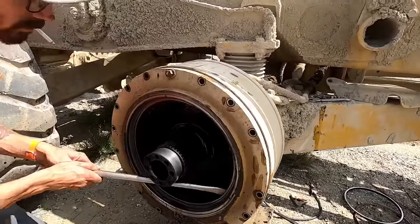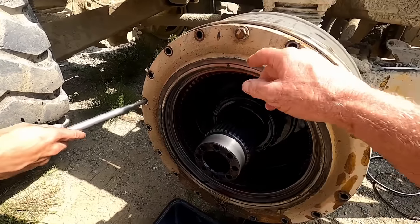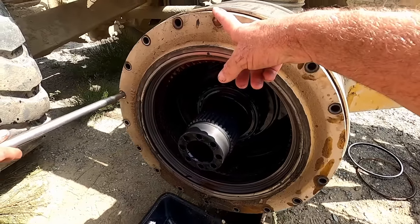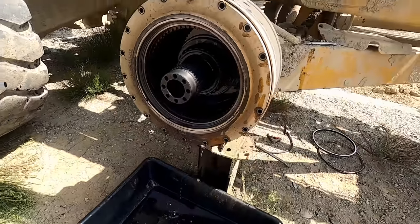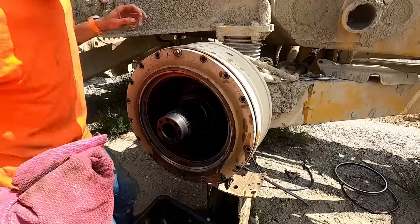On this retainer, it's heavier than it looks. One time I pulled one out, it slipped and crushed my hand in here, cut my knuckles down pretty bad. So what we do is put a bolt in here to kind of hold it up on that bolt. Once you get it popped out and released, you can just grab it — it only weighs like 60 pounds, it's not very heavy, but it's just heavier than you think. If it pops out and surprises you, it can hurt.